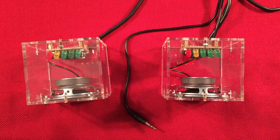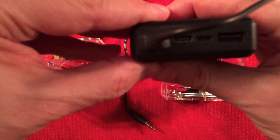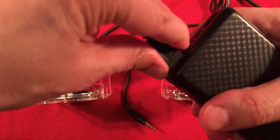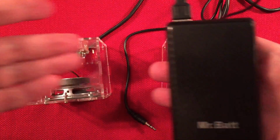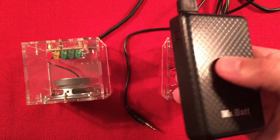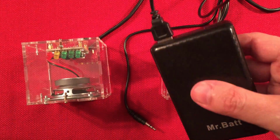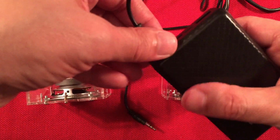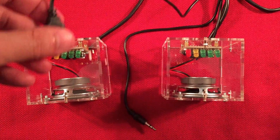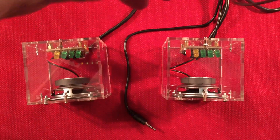So the best power thing, now see, it already turned off, even though this is a live circuit, as you can see with my power bank. This is good. You don't have to do any mods right here. This is done. This can probably be good for most uses, but as you saw, it does have RFI from the power bank itself. Not too bad. It doesn't seem to travel on the line much. But if you want the purest audio signal for DXing with radios, I recommend building your own battery pack.